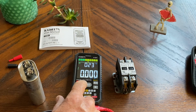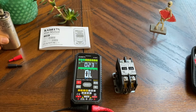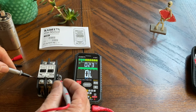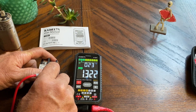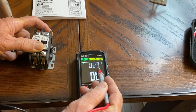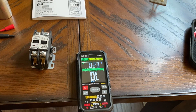Let's take it back to the ohms function and see what we get across the coil of this contactor — 1.322 kilohms. And this has been giving you the outside ambient temperature the whole time you run the meter inside the room, wherever you're working. It does give it in Celsius. I don't know how to switch that between Celsius and Fahrenheit — I'll see if it's possible.